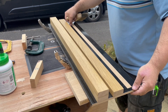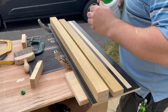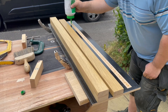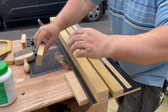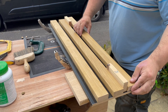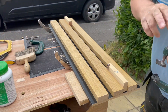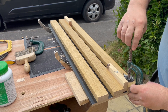I'm outside now and I'm gluing the oak to the MDF — you can see where I masked off the MDF to stop the paint going where the glue is going to go. I'm using a five-minute polyurethane glue here, but I've got to be quite careful not to use too much, as the last thing I want is for it to foam up and ruin the black spray job underneath.